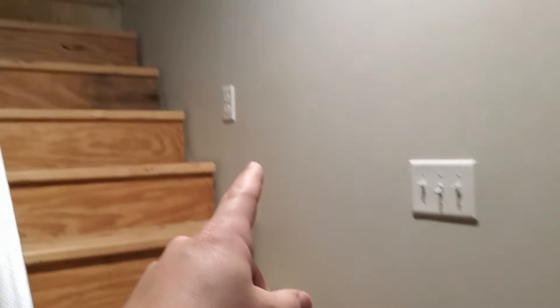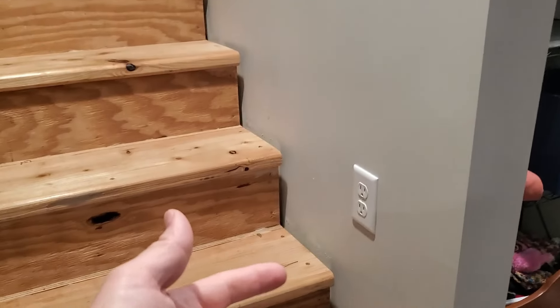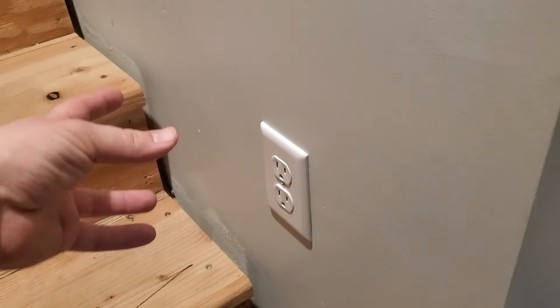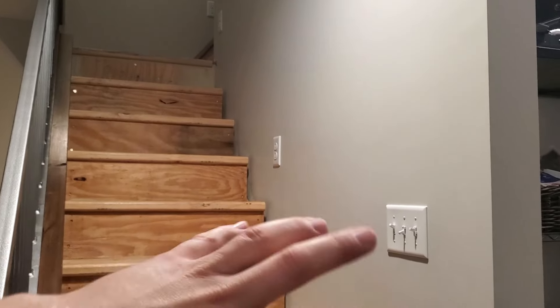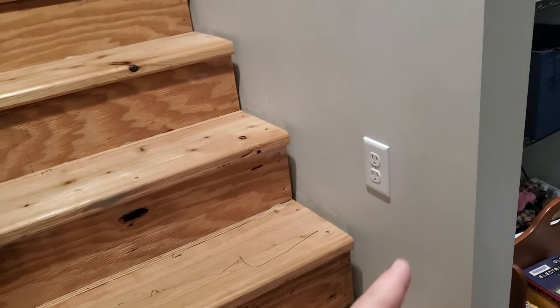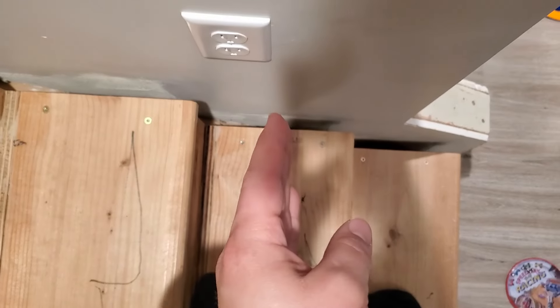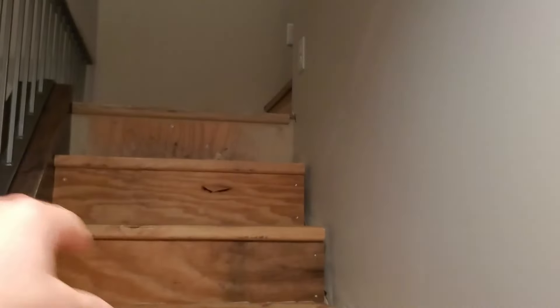Adding boxes that are evenly spaced along your staircase gives you flexibility if you want to add a pathway light. I actually just use standard receptacles and then plug in a path light that lights up automatically at night. But you could also put these on a switch if you wanted to control those separately. Just add your boxes and you can either use them as receptacles or add those path lights if you so choose. Try to keep them evenly spaced and pay attention to where it's positioned on each tread so it's going to be casting a similar pattern of light at each location.